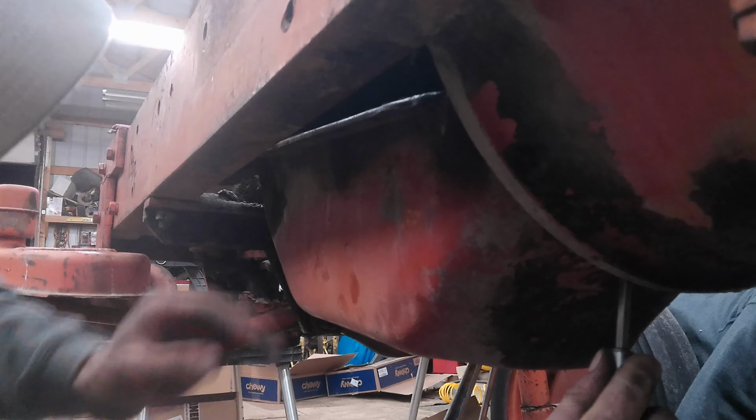Four cylinders, so we've got four connecting rods. This is connecting rod, and connecting rod up there. You can see the bottom of piston number four. There's piston number one. You can actually see, this is the liner that my finger is on. Horrible lighting, but the piston is inside of the liner and then the liner is right here. So this piston will go down a little bit farther. See, we're about halfway through the stroke. This crankshaft is pretty well parallel to the ground when you have either of the cylinders on top dead center, bottom dead center, then this thing will be down here another couple inches.